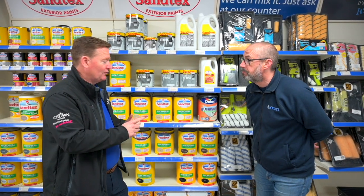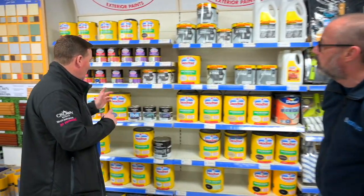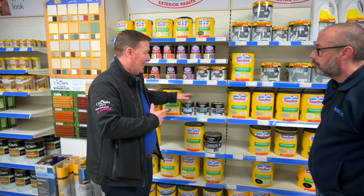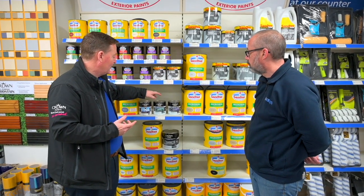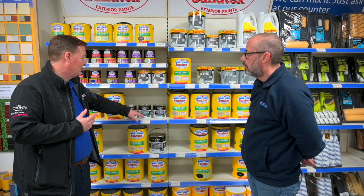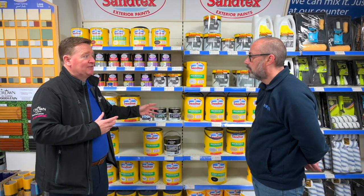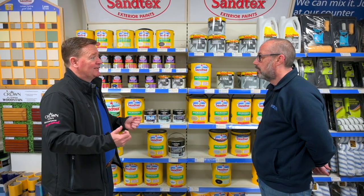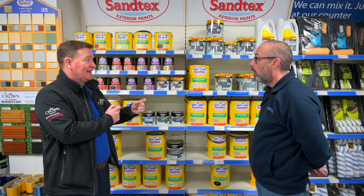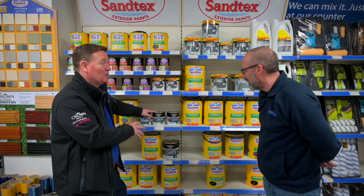Front doors. We've actually spoken about a couple of products you can use on front doors as well. We can use our Fast Flow system. One of the real benefits of using this on your front door — if it's bare timber — you simply go on with our Fast Flow primer undercoat, one to two coats of that, and then two coats of finish whether you want satin or gloss. Because it's quick drying, you can get the job done in one day, and when you close the door at seven o'clock that night you don't get that little sticky line one inch in from the edge of the door.